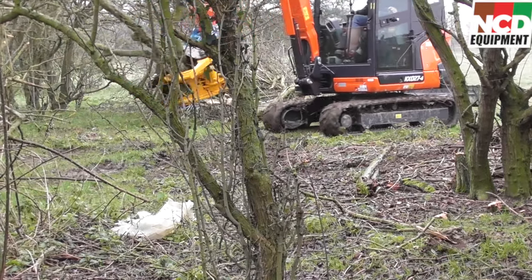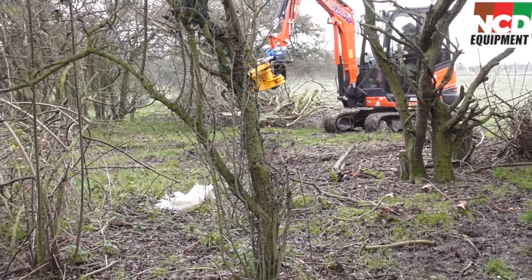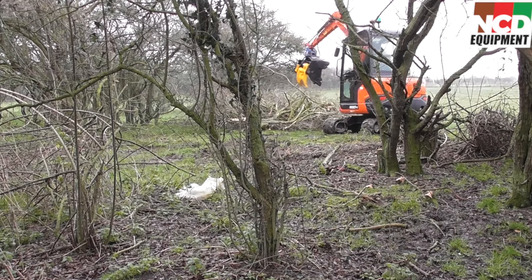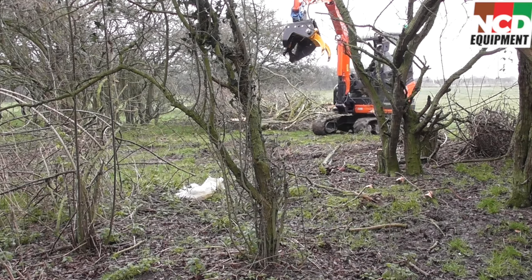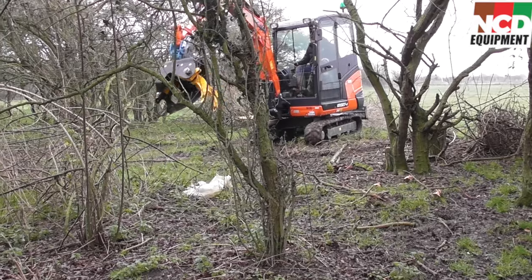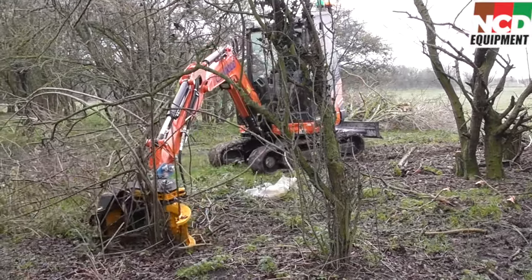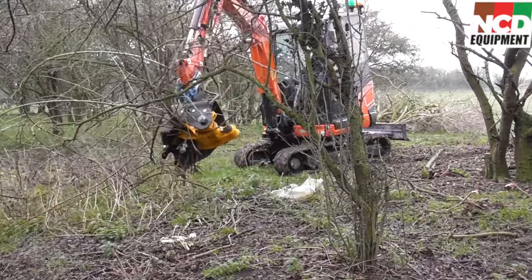TNK are always thinking of little solutions and they are the innovators in this tree shear design with the collector and attachments, wanting people to be as efficient as possible. When you're operating with these little two and a half to three ton machines, because you don't have the reach of bigger excavators, you find yourself having to track in and out quite a bit. So with the collector on there it allows you to accumulate more trees, resulting in less wear on the track systems, less time slewing around, and making the job more efficient.